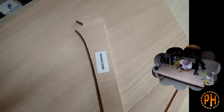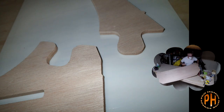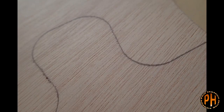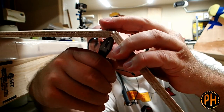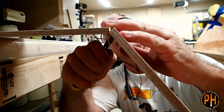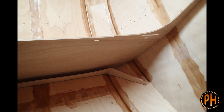Then I went ahead and sanded the joints after the epoxy hardened, since it's much more convenient to sand before you install than afterwards. The hatch stiffener comes in three pieces and is assembled by chamfering the short edges and stitching it together at the corners. It doesn't get glued together until after being stitched into the cabin.